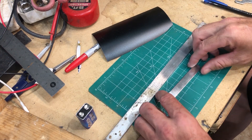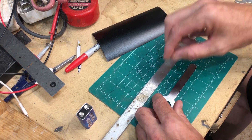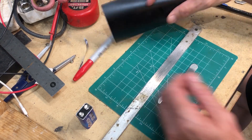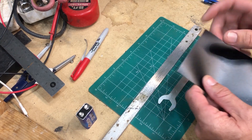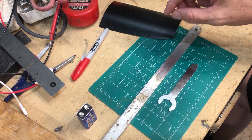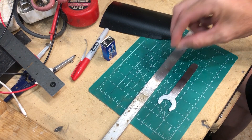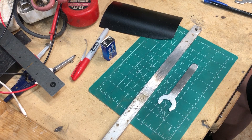We're going to test it out on steel and aluminum — I've already polished them up so we'll be able to tell where the etching is, and then we'll see how deep the etching goes and how wear resistant it is. I'm going to mask off sections with vinyl tape and cut out a design to etch. You need salt water, a 9-volt battery, and some Q-tips to dab on it — that's how he did it.